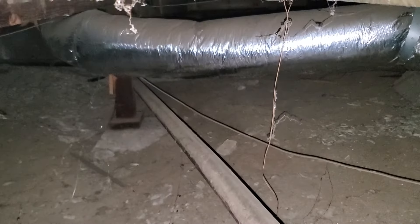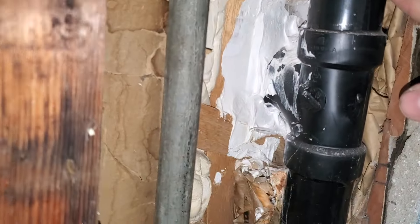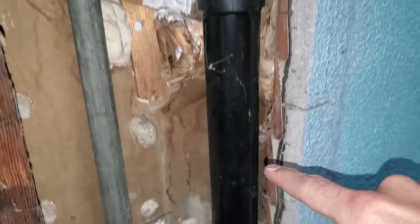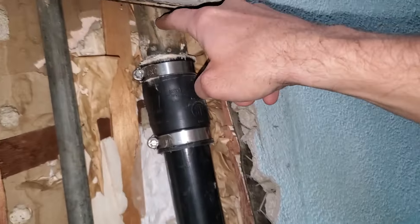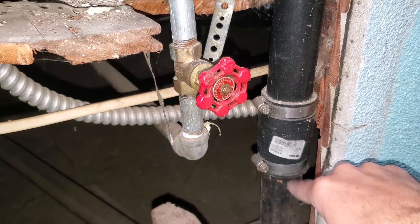You've got old galvanized drain in there. See this old Galvi? The galvanized combi shoots straight over to the main sewer, and we've got the clean-out cap here. There's the drain, the sink, and this is the vent. I want to see if I can get my big pipe wrench on there. This is ABS right here, this is galvanized — it transitions to ABS. I could just easily cut that. Got a little Fernco action going on here.